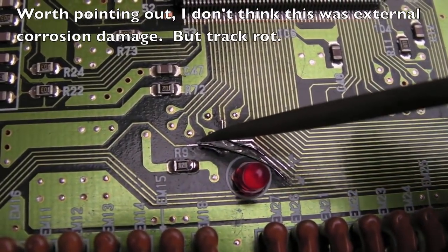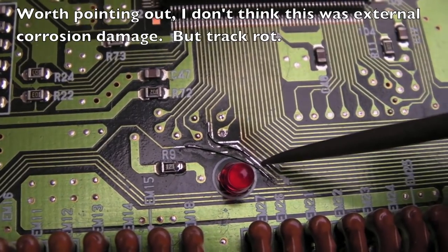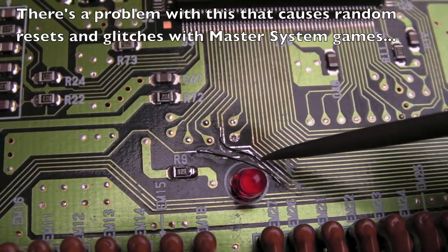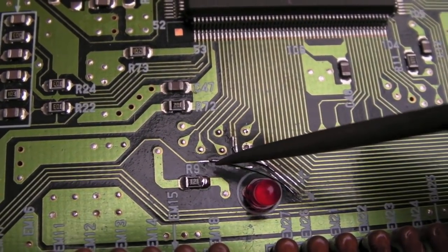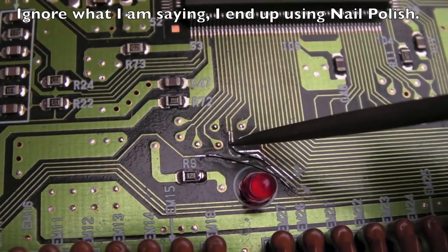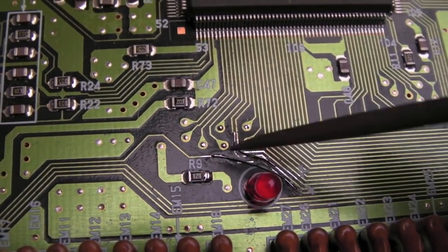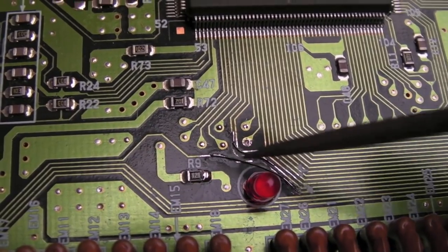So here you go, you can see we've got a wire join here, and then the enamel covers this. It's, let's say, transformer winding this, and joins up down here, and then the next trace inwards joins here, and then just goes up and round, joins up there. So all I'm going to do is get some of that lock nut slip stuff, I can't remember what it's called, I'll show you in a sec, just stick a blob of it all around here, just so it'll set, it'll harden, and it'll support those cables and protect them in those places.